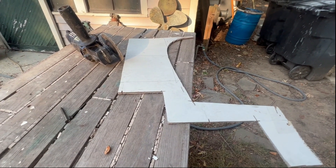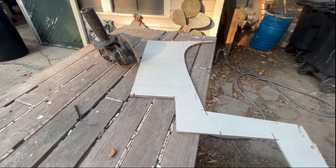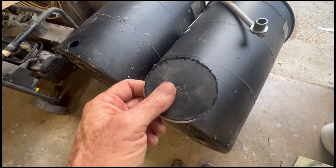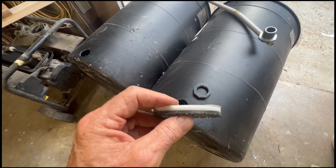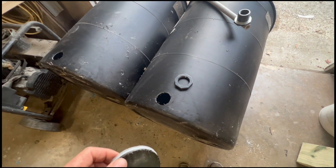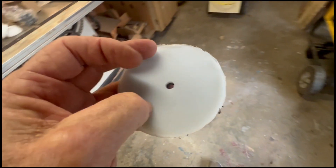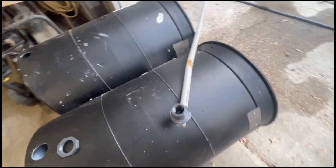Remember a couple of weeks ago when I finished the fiberglass holding tank and I resisted throwing away the last few pieces? Well, here we go - found a useful one. Interesting tank: it's white on the inside and black on the outside. If you're going to have a water tank it's got to be black, because if any sunlight gets in you're going to grow algae and it'll turn green. So I got black tanks - added benefit. I like this white lining; it's super hard. I think these were for acid, so I guess it's a better plastic than normal.